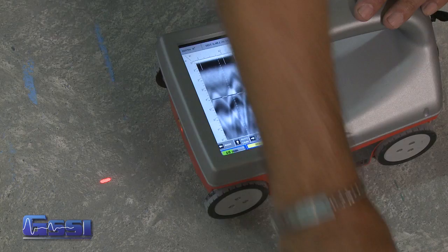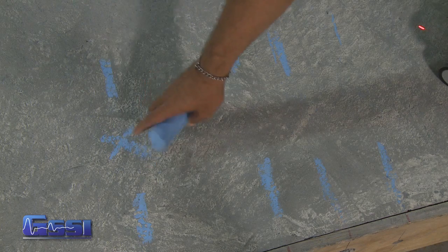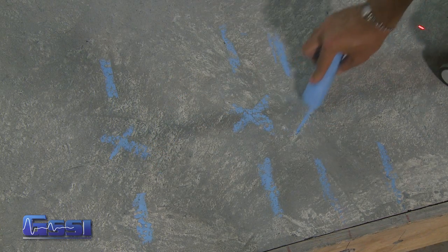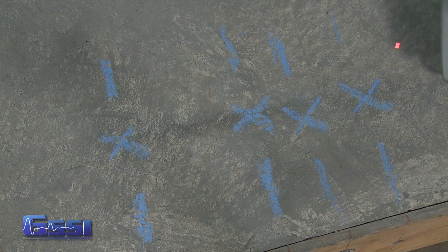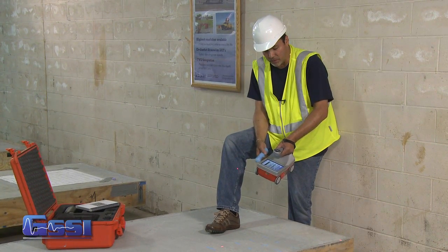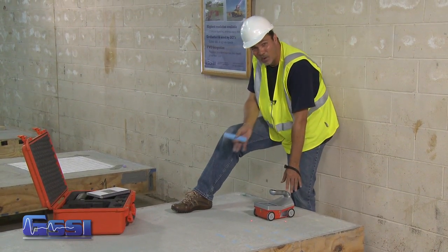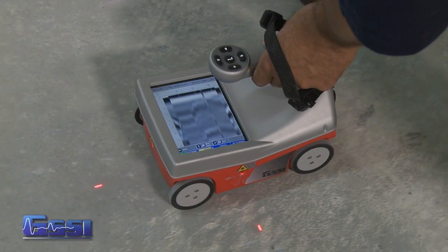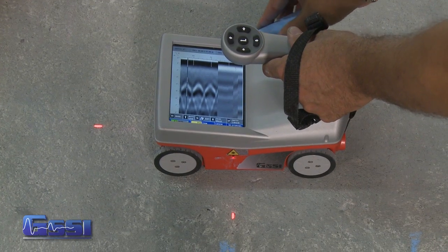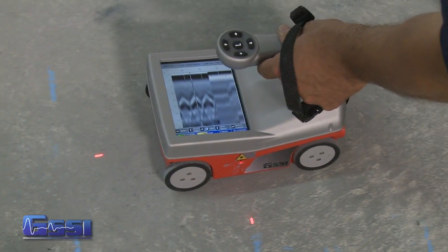A bright hyperbola is probably metal. After I've marked them, I want to place an X in between the lines that I've created. The X represents exactly where radar saw that target. Then I continue this process, rolling the wheel forward until my data is blank, start about three, four, five, six inches over, and do the exact same process — roll forward, move it back, and place the lines where the backup cursor bisects a hyperbola.